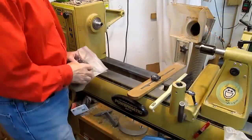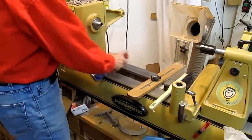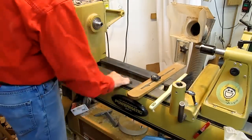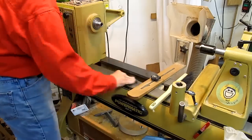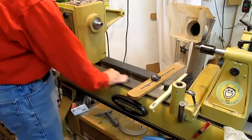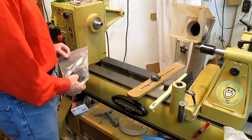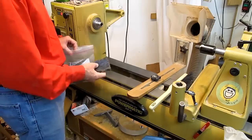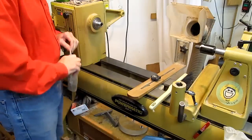The next one is a tip I picked up from John Jordan. Not exactly a jig or a fixture, but periodically I use a little WD-40 on my bedways and then use a scuff pad — a real coarse one — to rub it in and clean it off a little bit. I don't get crazy about it. I have an indoor basement shop that's temperature controlled, so I really don't have a lot of concern about rust. But this does make it easier to clean up if I'm turning something like red oak that will have a tendency to cause rust or discolor.